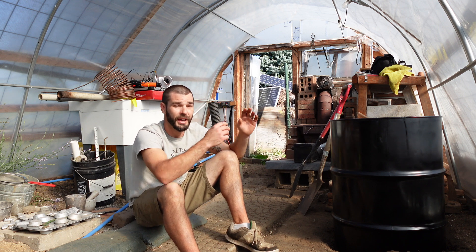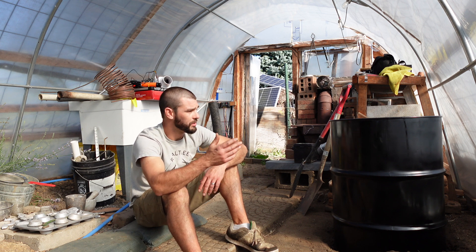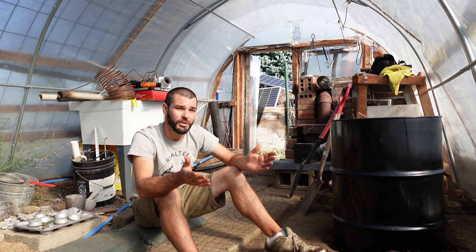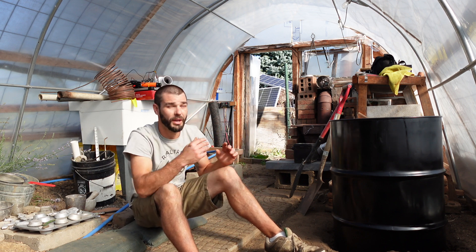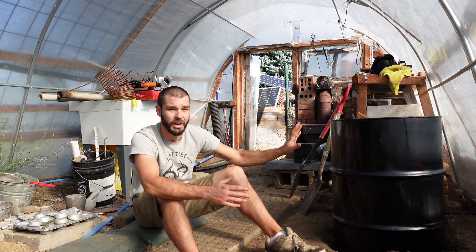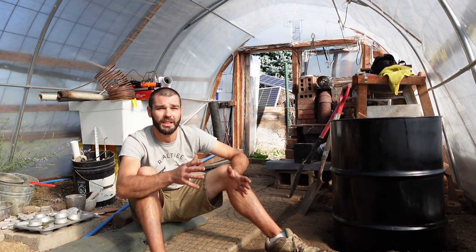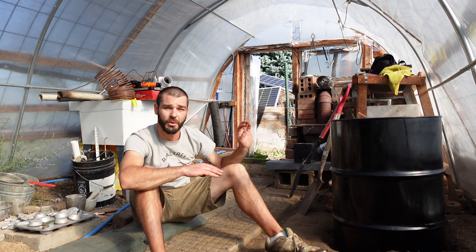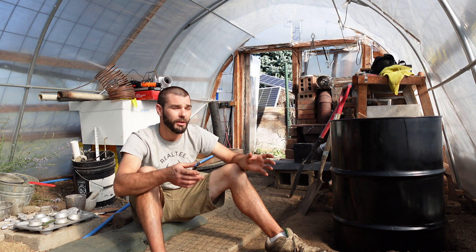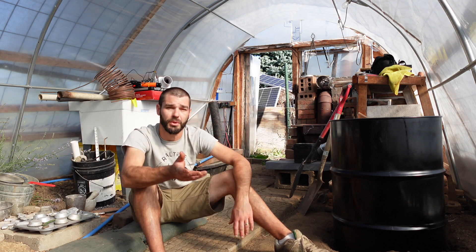So today, this black drum — I had some old cans of spray paint and I ended up spray painting it down and sealing it up. There was a little bit of rust, so I went with a black color to really double down on the factor of trying to absorb heat. If we don't have a fire burning to heat up the barrel, a sunny day is going to heat it up. Now this barrel is going to be full of water, like a normal thermal mass. Sand takes a lot less energy to heat up, but water holds that energy much longer and re-releases it. When comparing specific heats, water is about four to five times that of sand, making water the best thermal mass you can possibly have.